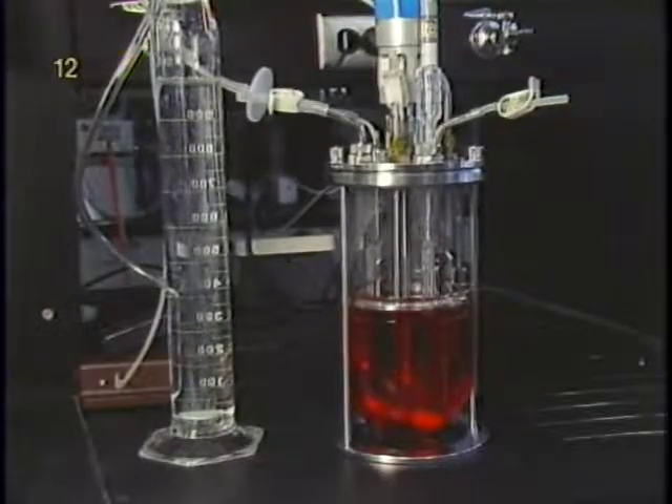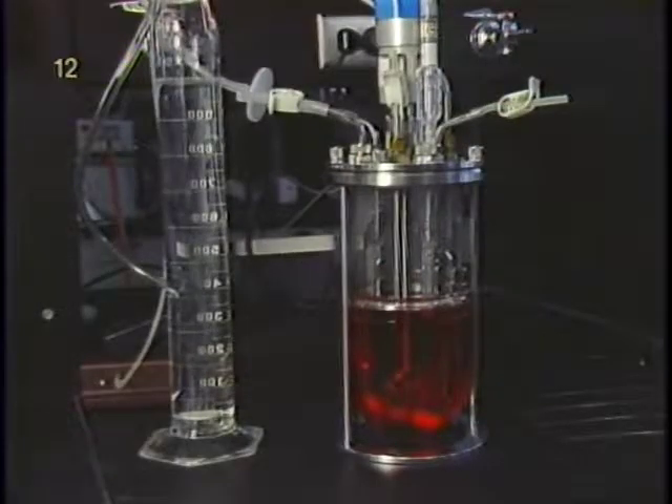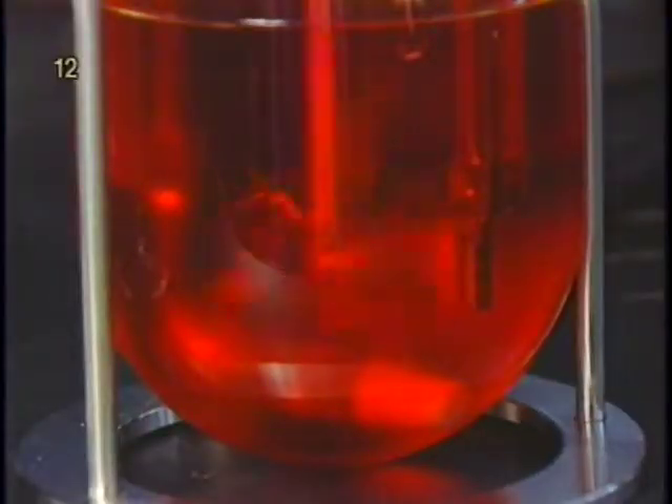The second method of sparging is to inject a swarm of small bubbles directly into the culture. The small air bubbles are usually generated by passing air through sintered stainless steel or other porous material with small openings. The pressure drop across the sintered stainless steel is relatively small. The diameter of the bubbles ranges from 0.5 to 2 millimeters, and usually a very slow airflow rate is used.